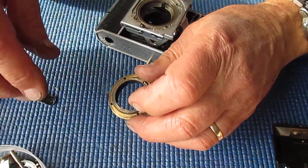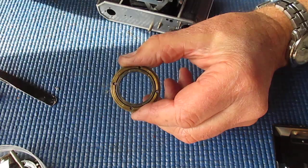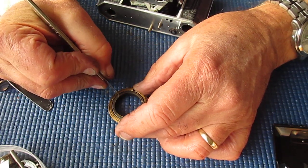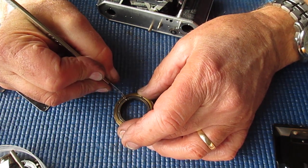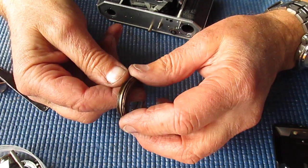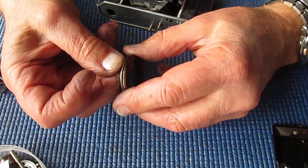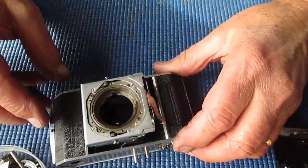Right, says the inner and outer helical, and what I'll normally do now is I revolve those down until they are level. When they're level, I can put my mark in there in line with my other two marks. That one's inconveniently placed right there, but we'll just pop it just like that. And then I know to reassemble those rings to those lines at that handy reference point when those two surfaces are flat. Those bits are very scungy with old grease and will need to be cleaned.